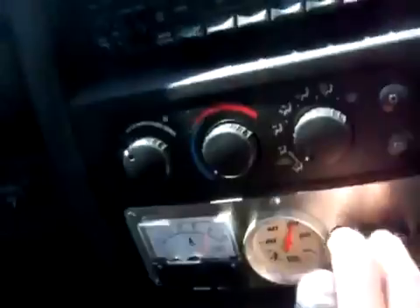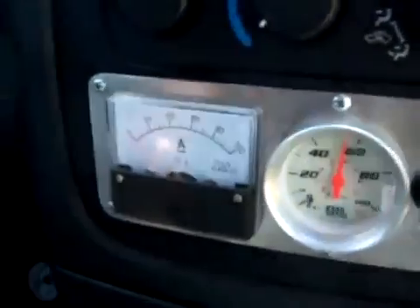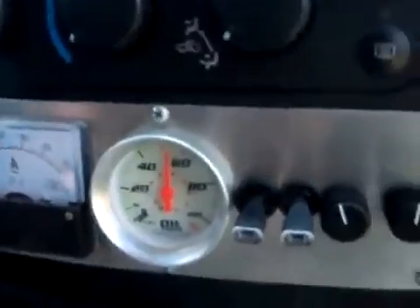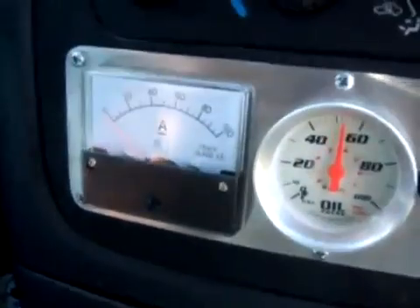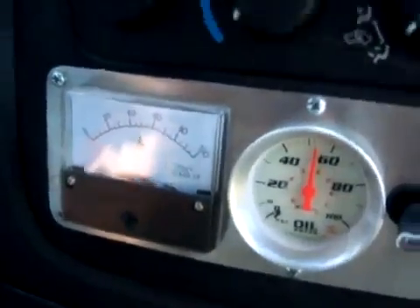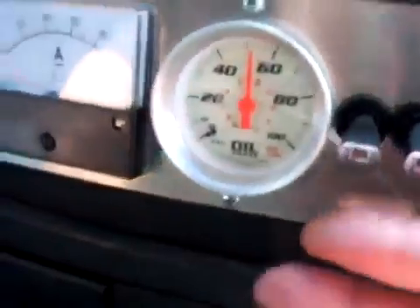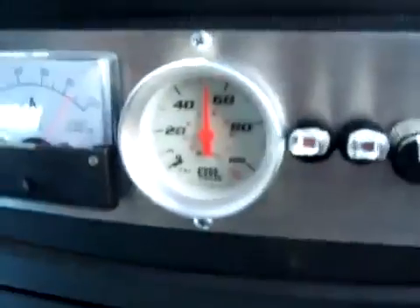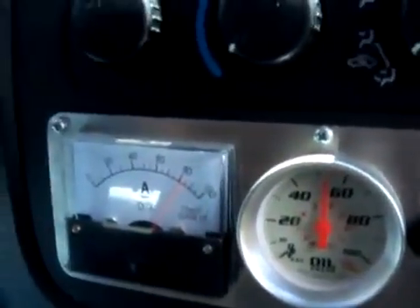We have so much hydrogen, I'm just going to shut off the generator and let's cruise home on what we've got in the vessel. This is for all those skeptics that say you've got to have mass quantities of hydrogen. Now we're cruising on what we've got in the vessel. As you can see, we've gone from 60 to 50 PSI just going underneath the bridge — it's going to get dismal. We're starting to go below pressure, so we're going to go ahead and turn it back on. We've still got some power issues.